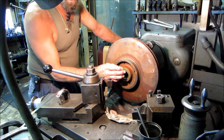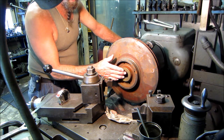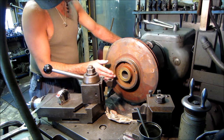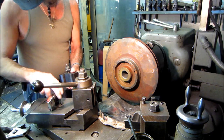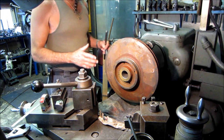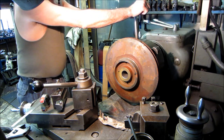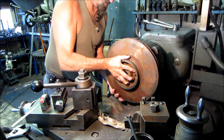It's kind of the whole key secret of totally eliminating all the corrosion on the hub of the impeller, which makes the steel shaft last that much longer. We do another couple of tricks to that shaft and we'll show you that on assembly. All right, so we're going to get this out and get our mess cleaned up here, because we are going to pull a gap and put in the faceplate, and we have another big job. We're going to be running two jobs together, this pump and a sprocket drive for a winch on an antique crane. So we're going to go back and forth.